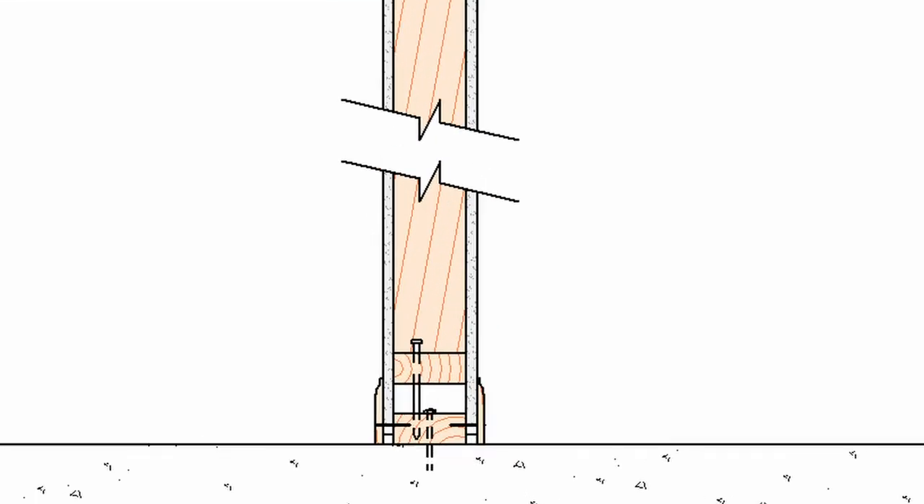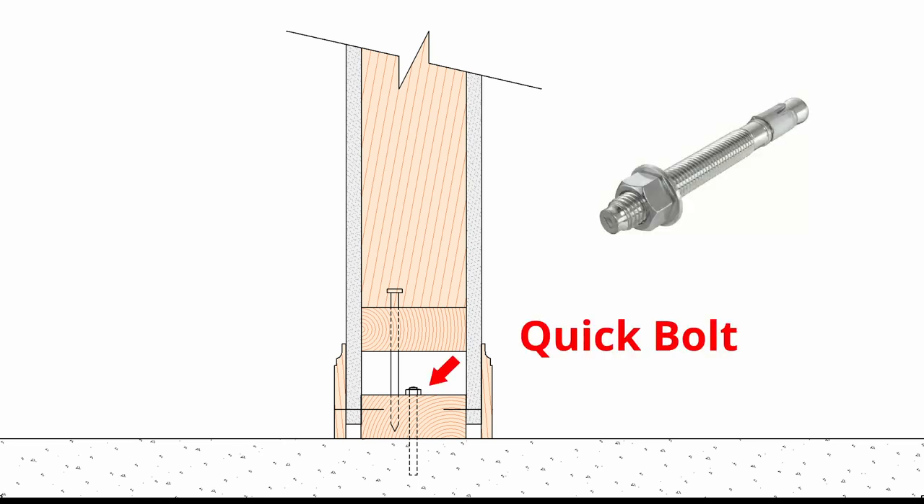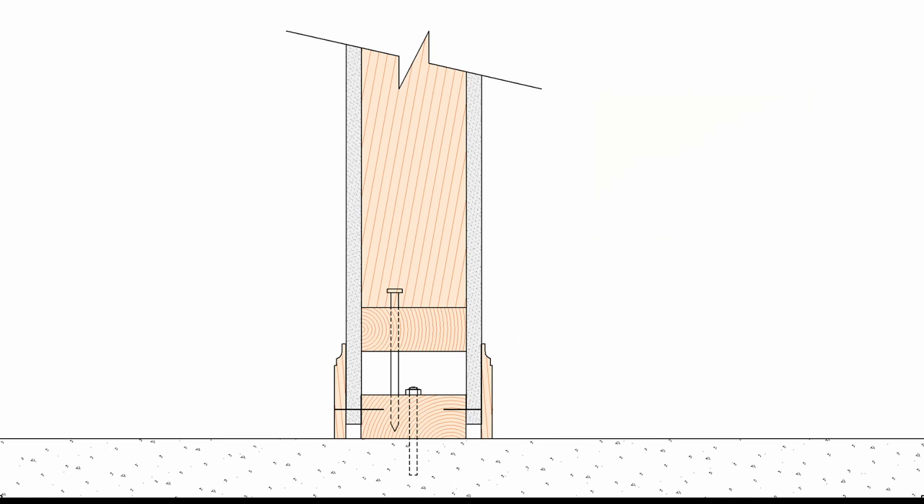Next, I show the detail of how the bottom of the wall is constructed and how it works when the floor moves. I use quick bolts to attach the treated lumber base plates to my basement floor, simply because this is the method I've used in the past — they use the tools I own, and I like them. I'll provide a link above and in the description to a video by The Essential Craftsman, which covers a number of different methods to fasten wood to concrete.